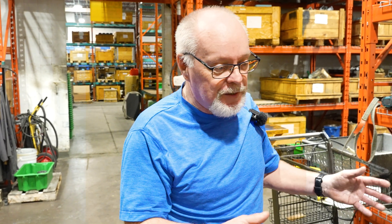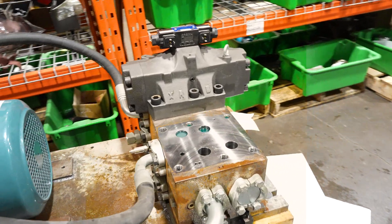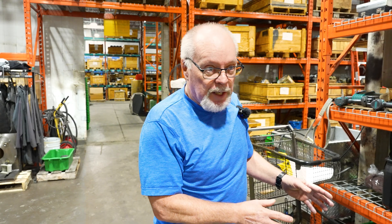Something's not adding up - it's like there's multiple issues. I talked to the customer and came to the conclusion: just send us everything. The unit the customer is trying to modify, trying to make an aluminum press, because aluminum goes through a big cylinder. So the first step, we checked the pump, because if he's been running the pump with no pressure, it could be destroyed. The pump was perfectly fine.